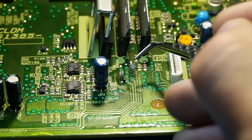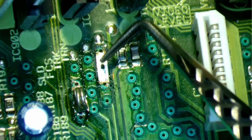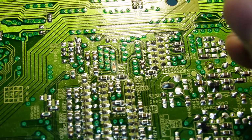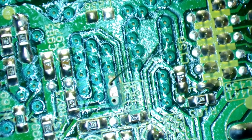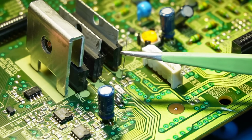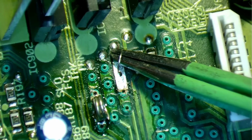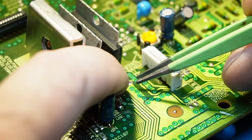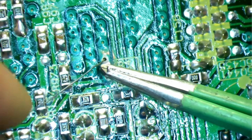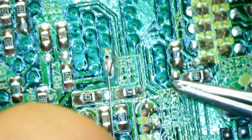So we just push our damaged track back down. Hopefully we don't tear it. Hold it still. So what I'm going to do is try and feed this wire through that hole. Like that. So now that wire's come through this side, I can bend it over. Push it in. So I'll pull that through. Pull it tight, and that should be tiny. It's a bit like doing a suture. Maybe I should work on people.